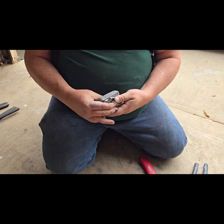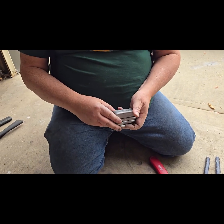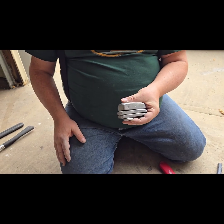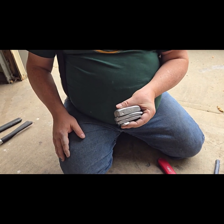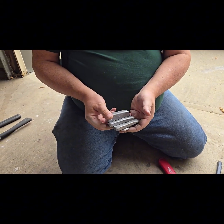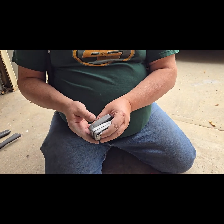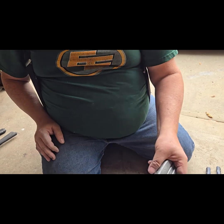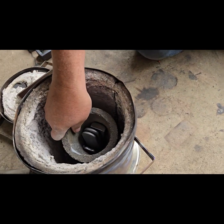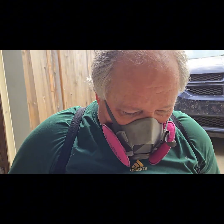We're going to talk about what I've heard is Archimedes' way of determining density so that you know roughly what you have in your bar. Because I have bars that are mixtures of zinc and aluminum. It's nice to keep them separate, and I do have some bars of pure aluminum. But quite often they're a mix. He also has Zamac. I won't talk about Zamac today too much, but that is also a consideration.